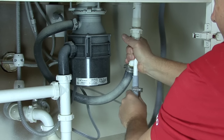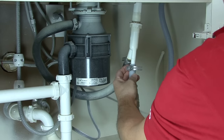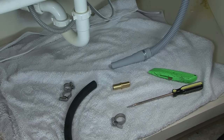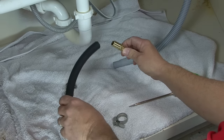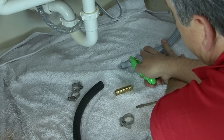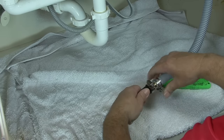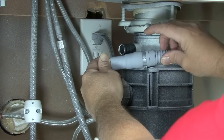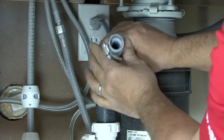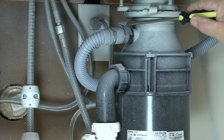Take the drain hose and attach it to the connection under the sink — it could be an air gap, a disposal, or a drain line connection. Attach the drain hose to the air gap using the smallest connection supplied and secure with a clamp. If you need to extend the drain hose, use a brass splice connector to attach more hose, cut to the proper size and secure with clamps. Connecting to the garbage disposal is the most common installation — cut the hose at the 7/8-inch size and clamp to the drain connection on the side of the disposal. Make sure the plug in this connection has been removed if this is a new disposal, then secure with a clamp.